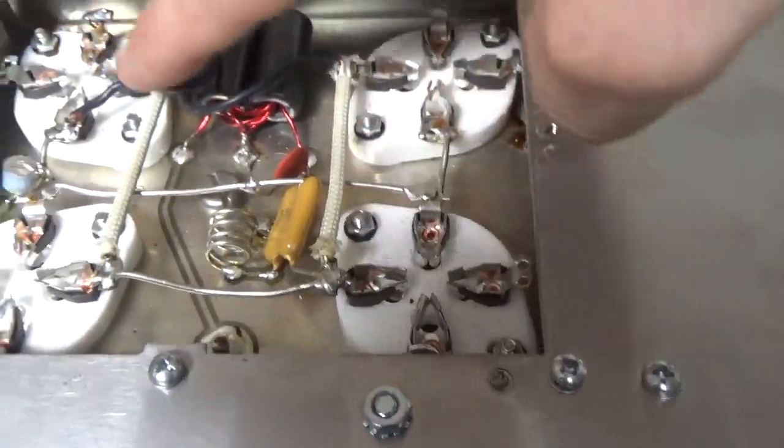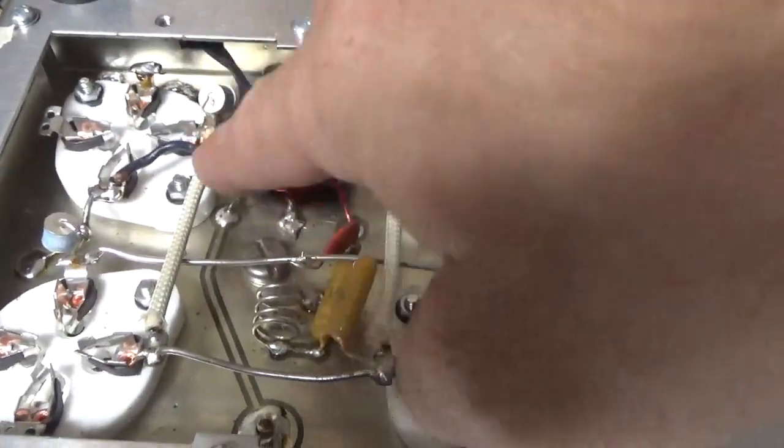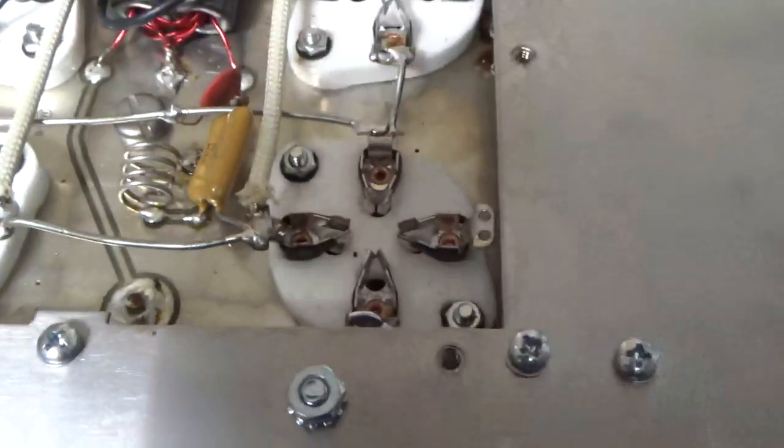Added the two gas discharge tubes — one per side of the filament, one there, one there. The wire had some insulation damage, so I put some heat shrink over it, unsoldered it, put the heat shrink on, and re-soldered everything. Compressed the socket clips.